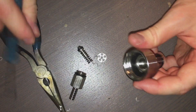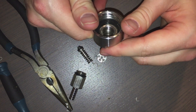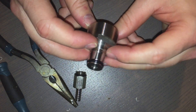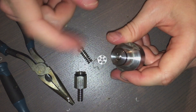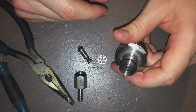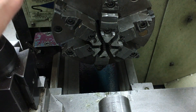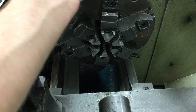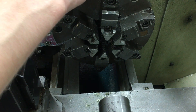So that's what's inside that valve — I've explained that in a different video. You're just left with this one steel piece, sort of a husk of the valve. We're going to use a lathe to drill into this and tap it using a 1/8 inch NPT tap. Here we are at the lathe. First thing we're going to do is put our part in the jaws. We're going to drill that hole so that we can tap with a 1/8 inch NPT. Because of the shape, there's not actually going to be that much thread engagement after we do that.